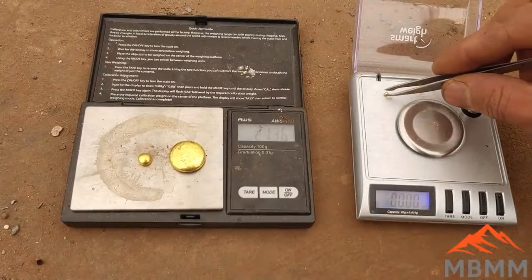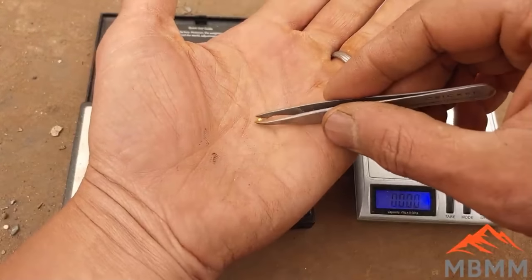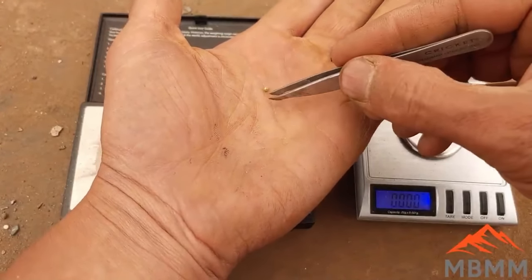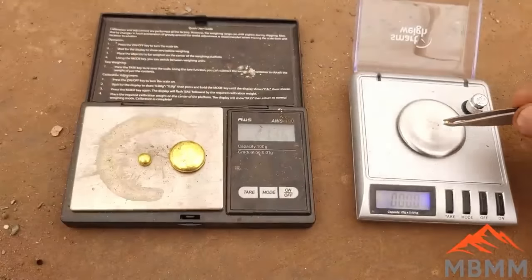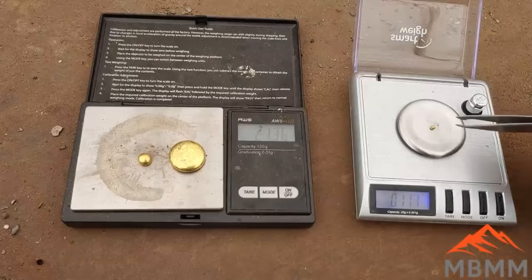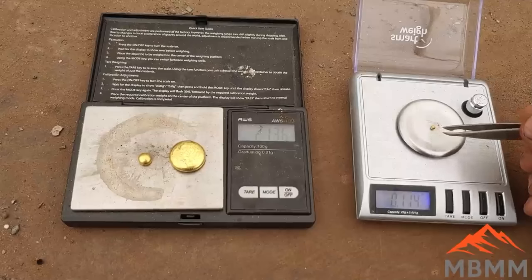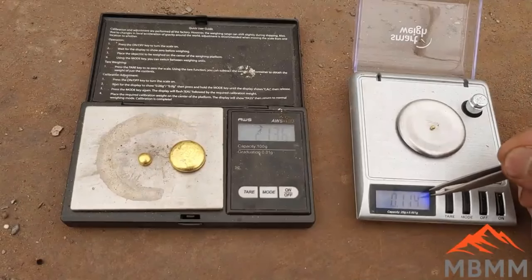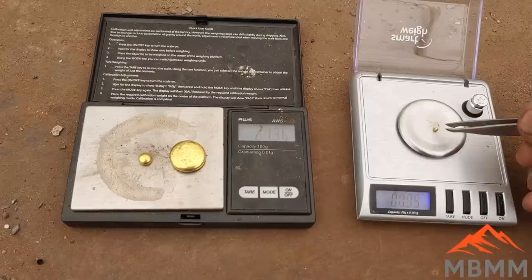And then I took some of the number two high grade that we had and smelted 300 grams of the number two and ended up with this little tiny bead here, which weighs right around a tenth of a gram. And I've dried out and weighed the rest of the number two concentrates, and I have about 3 kilograms of that stuff. So multiplying this number by 10, which I have about 10 times as much left, there's about a gram left or so in the number two high grade.